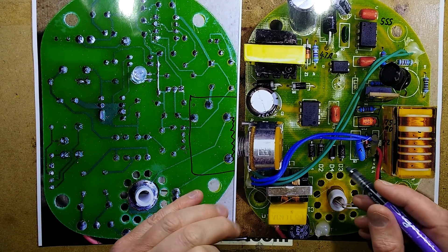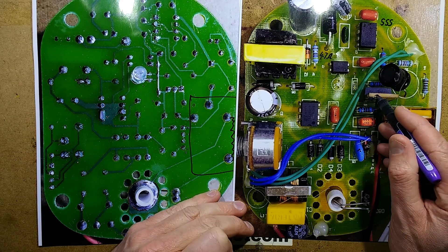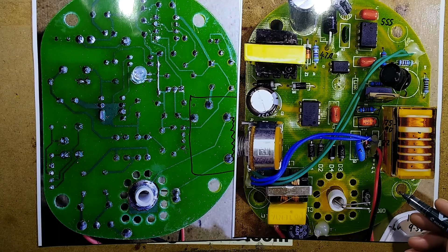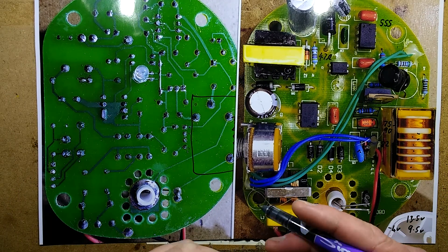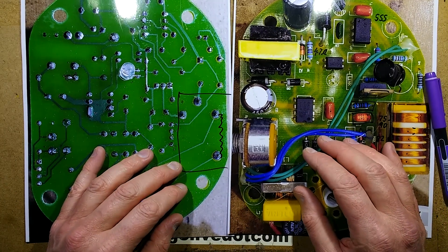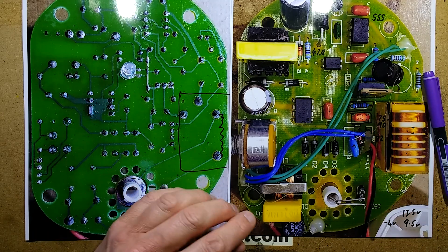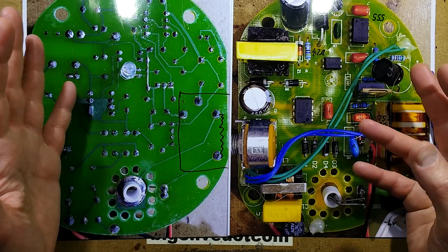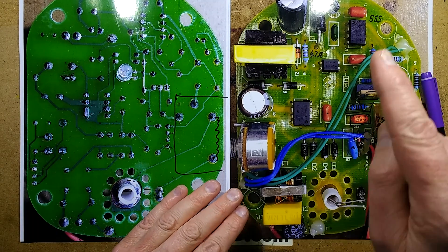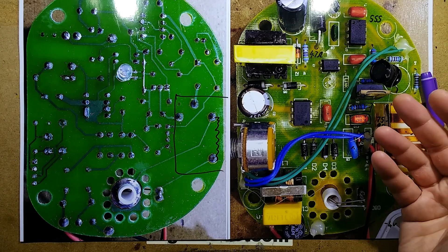It's a logical design with a few odd quirks — most notably that suppression circuit and the capacitor getting very hot, which is really just to protect the MOSFET. This thing does just generate tiny quantities of ozone. It's not trying to do what some of the plates you get on eBay do — those just blitz ozone out and are designed to deodorize entire rooms, preferably while they're not occupied. Hotels use timer units with big ozone plates and big fans — they wheel the unit in, plug it in, set a timer, leave the room, close the door, and the unit pumps out a large quantity of ozone to sterilize the room and get rid of all those chemical and organic smells.